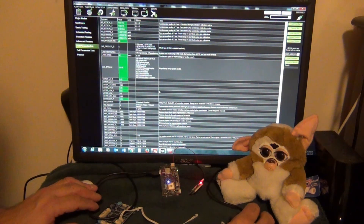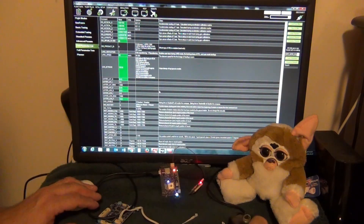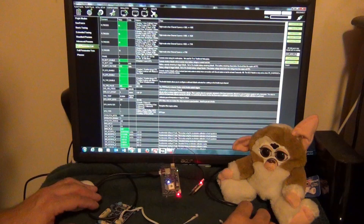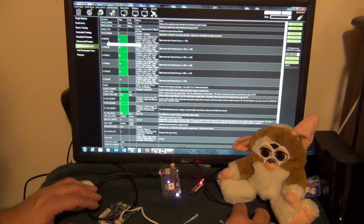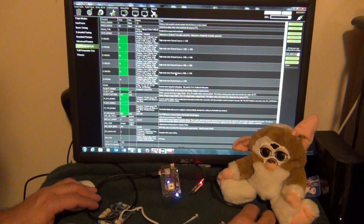You can go over it, check it, and tweak things like throttle voltage, when you want it to return home, and how the switches act — all of that is changeable on APM boards. The geofence — which isn't initialized in the Up Air — is something like what NASA uses to keep the drone from flying too far or too high so you don't lose it. It keeps the drone within a certain area. For flight modes: this says flight mode 1, there's number 2 — look at the legend and 2 says Altitude Hold. If I put 13 in here, that's Sport Mode — this Up Air would fly like a bat out of hell. Now I'll hit Write Params to write the Up Air program to that board.